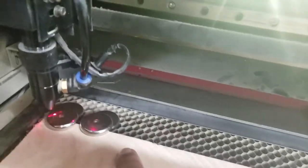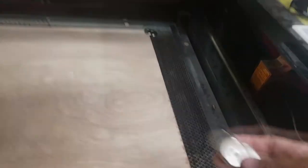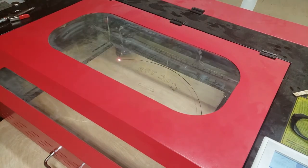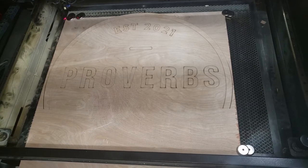Here's a little trick with the magnets: use these small circle ones and offset them so they form a Z-shape. You use it like a clamp to hold the wood down — it works really well. It holds it down kind of like a picture frame.